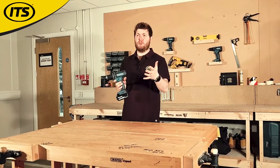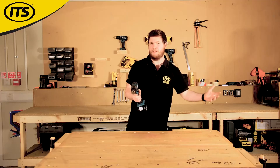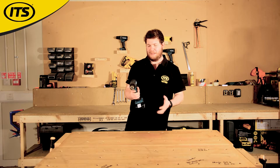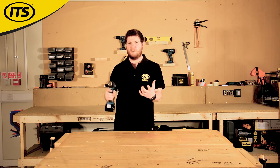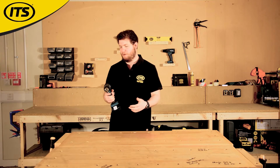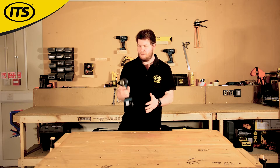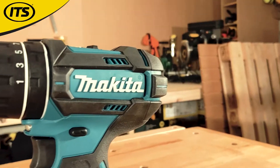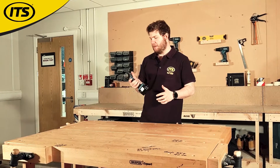It's what we would call a general duty drill. It's not the sort of light duty combis predominantly made for domestic DIY around the house, but also it's not heavy duty construction — the sort with side handles going up to 100, 125, 130 Nm of torque. It sits somewhere in the middle, so the vast majority of jobs on site you're going to be able to do with one of these, as well as everything you need to in a domestic environment.